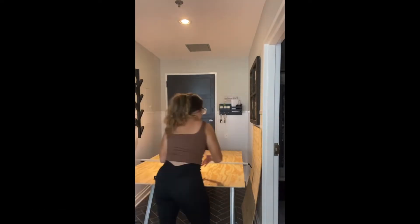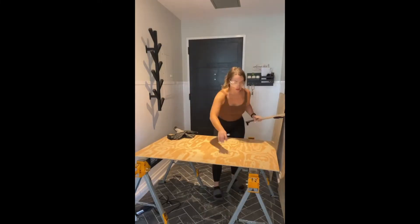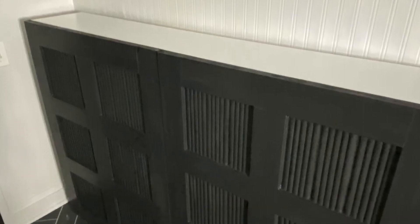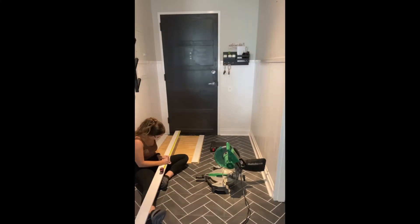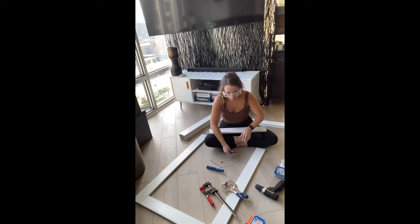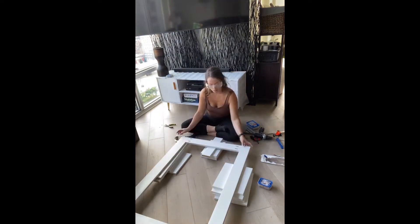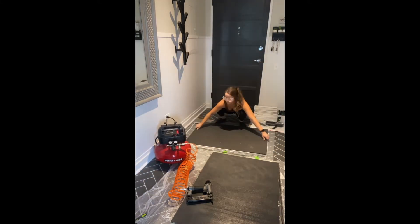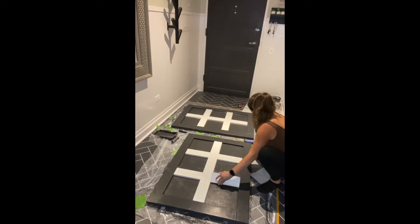I'm adding those shelf pin holes so I can easily slide in the shelves. Making the cabinet doors was actually pretty intimidating because I had no idea how I was going to make a straight cut on plywood — check out my tutorial on how I used a track saw for that. To get the frame look on the outside I used a 3.5 by 1 inch board, and on the inside I used a specific fluted molding from Home Depot, which I'll link in the description. I went back to the pocket hole jig to put it together before nailing it onto the plywood, and I wanted to prime and paint it before nailing it on.